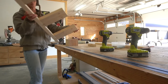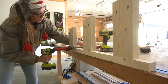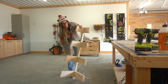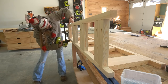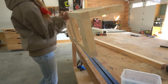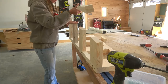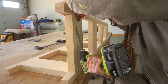After one side was done, I repeated for the other side, making sure to install the screws so that they wouldn't run into each other on the corner post. Then it was time to add the front corner posts. I made sure to angle the ends correctly before securing, then just like before I started at the top and secured the slats to the post, keeping equal spacing as I worked my way down. It hurts my shoulder to drive the screws going upward, so I tried flipping it over, but that was kind of a mess and I really needed a second set of hands. Feel free to position the boards however you're able to clamp and drive — as long as it's together at the end, that's all that really matters.